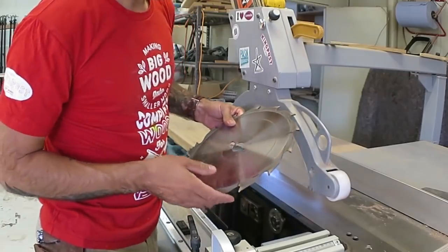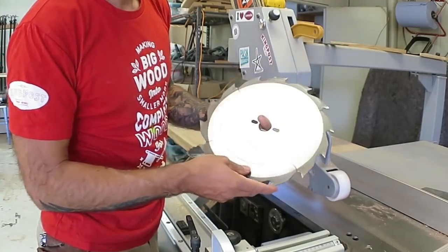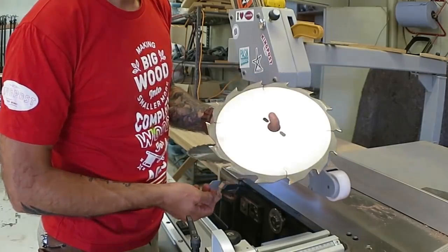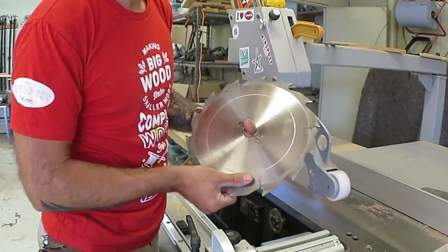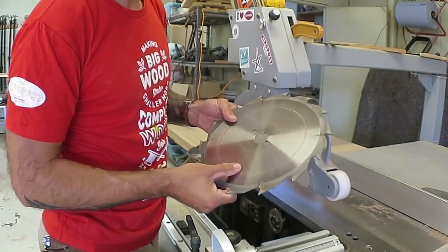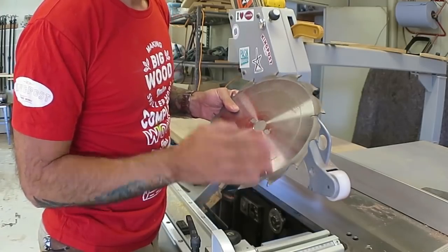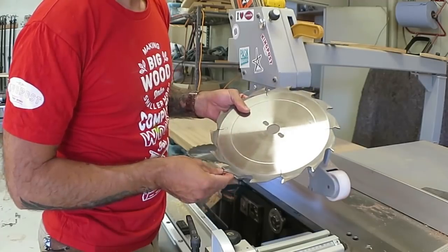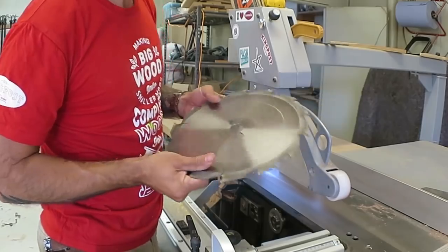Okay, so my preferred blade for ripping is this huge 14 tooth Lin-bide rip blade. If you just straight up want to rip some timber down, this will do it like butter, but because it's got so few teeth, the edge is always a little bit furry, the cut edge, and it's not ideal for going straight to glue up.